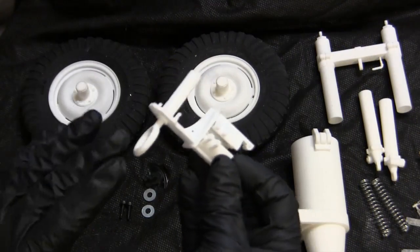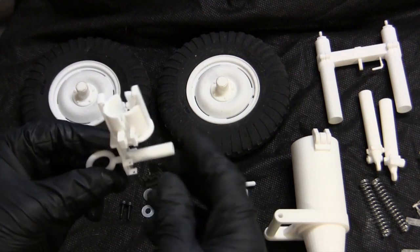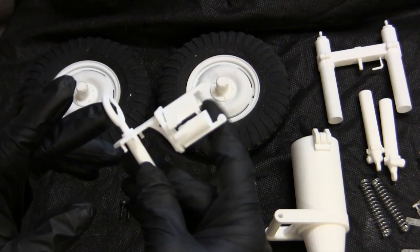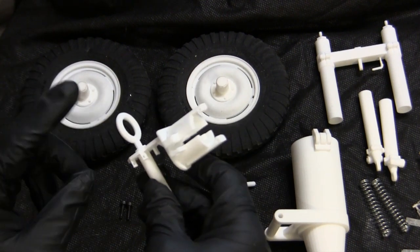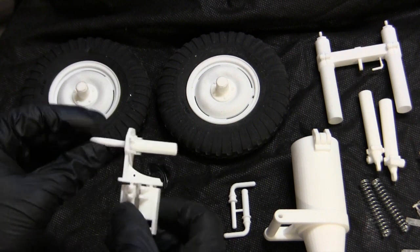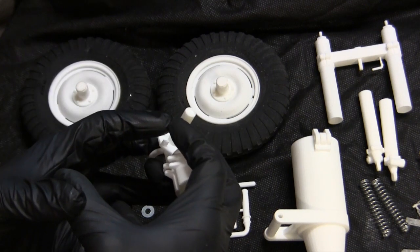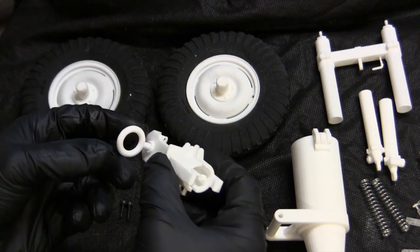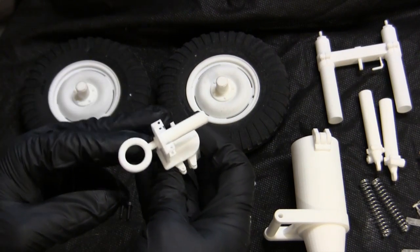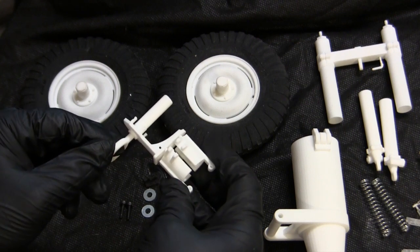Now, this is one aspect of this version of the M27, which is very unique. Unlike the M22 trailer, where the long trail utilizes a lunette that's built into the rear section of the unit, on the T47 Modified, they went with a different approach. The approach they went with is this cluster type assembly, which has a clamp mechanism. The way this works is that you would insert this into the end of the barrel, and with this clamp mechanism, it would envelop the sides of the barrel, and once tightened on, prevents the unit from getting loose, and then you could just tow the entire unit with a Jeep or any sort of vehicle with a tow hitch. It's a very interesting concept, and I'll go over how it works once it's fully assembled.